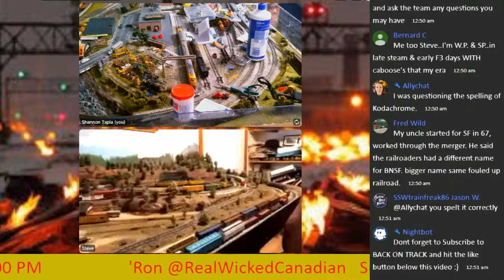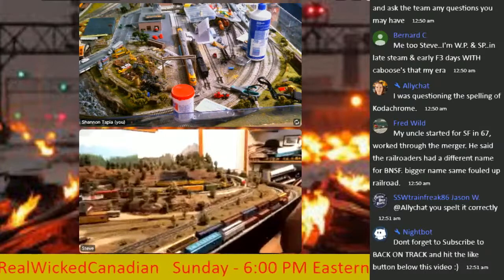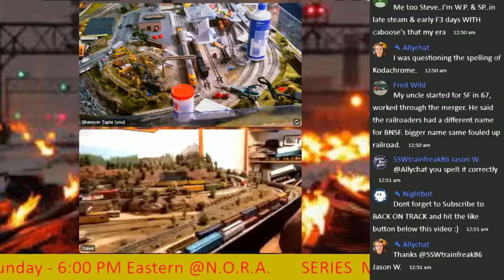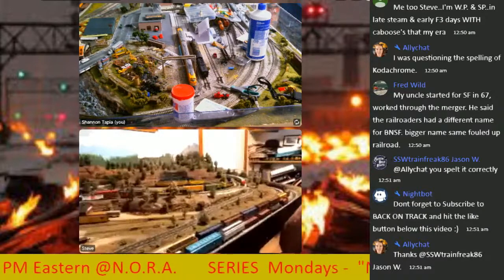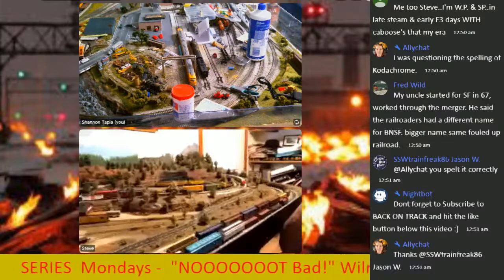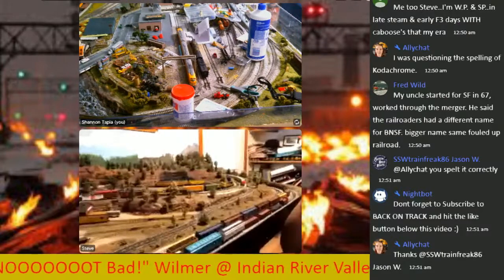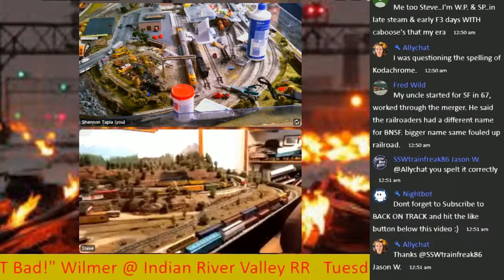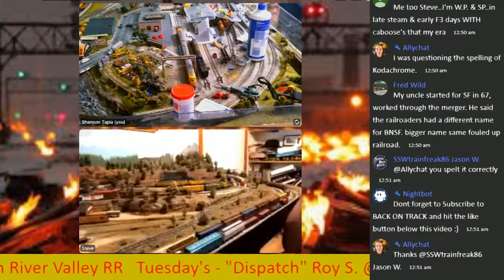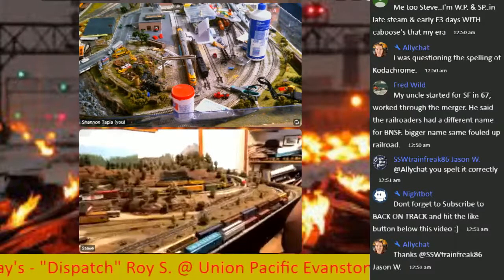It's like, what's it called, a coupler box or something? Well, I'm not sure exactly what you're talking about, but the drawbar that connects to the underframe of the car is big, and then you've got the knuckle on the end of that. Basically, where the coupler sits into the chassis of the freight car, the gooseneck of the coupler broke. So the knuckle was fine, and the chassis was fine, but the coupler broke in half. Yeah, from stress fracturing.